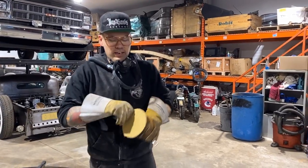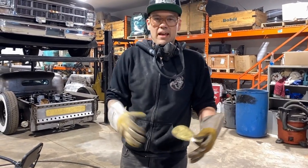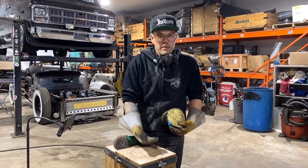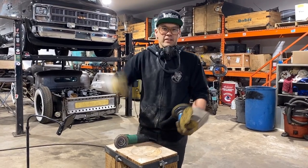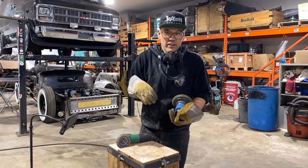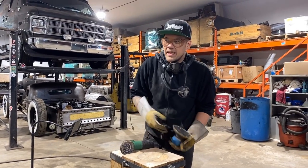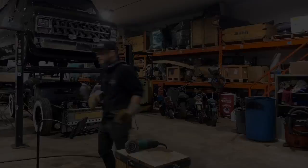Okay, I'm just gonna take a piece of 80 grit and just kinda smooth it out a little bit. I just wanna add right now that how perfect this is doesn't really matter. You're not trying to get this shape perfectly imprinted on your metal. You're just wanting a void to hammer into to instigate that wrinkle that is the tuck for shrinking. So this doesn't have to be perfect. I'm just gonna sand it to make it pretty. And I probably put a little bit of linseed oil on it, seal it up a little.